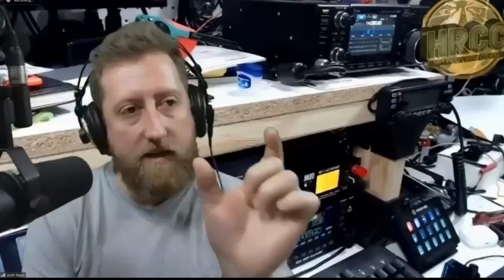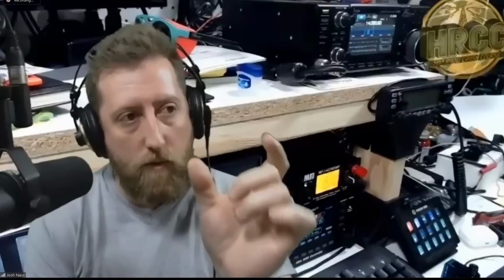You got it. Yeah, it's got a strain relief in the middle for the radiating elements, and then it's got the two alligator clips that you clip together. So on 20, you just disconnect all of them, and you've got the 20-meter radiating elements, and then you can just add 30 and then 40. It's fantastic. The first time I used it, it took me 5 minutes to set it up, and with the KX2 there's a button you can hit to see the reading on the SWR meter, and it was just flat. It was great.